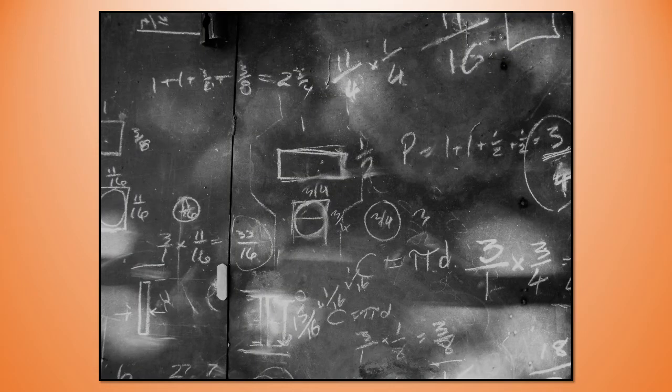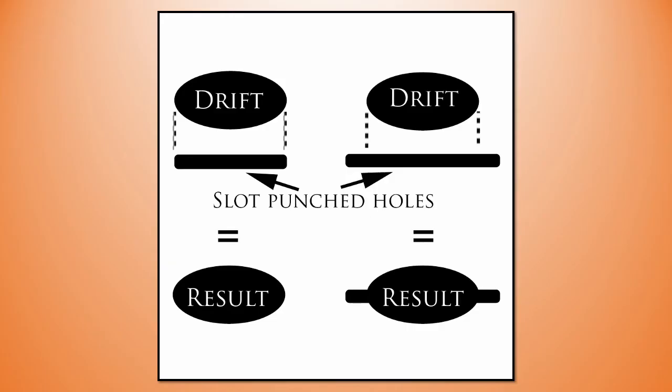Now to the math side: how wide should a slot punch be? Looking at these examples on the left — this is our intended outcome, something like a hammer eye — the slot punched hole should be as wide as the drifted hole for a clean result. If I am too long with my slot punched hole and I'm punching and immediately drifting, the result is I'm going to see evidence of the slot punched hole post-drifting. For me I think I can go about a sixteenth of an inch oversize but no more, otherwise I see that evidence after the drifting process.